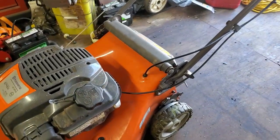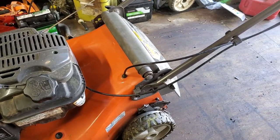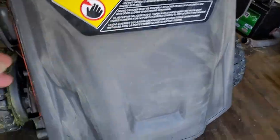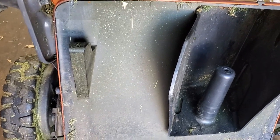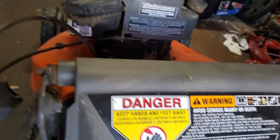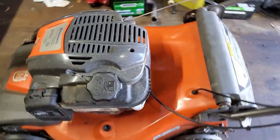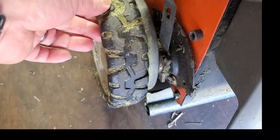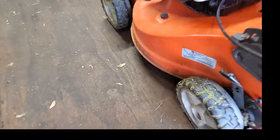This also had a cable in the back that rotted away because grass got in there behind this door, inside next to the discharge chute. The cable rotted away to engage the self-propel and the owner didn't even realize it wasn't working anymore. When I lift this up in the air, you can see this wheel is really loose and the one in the front has some play too.